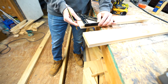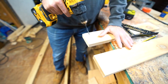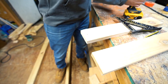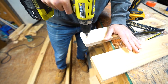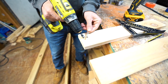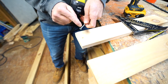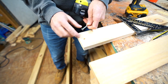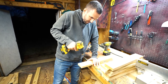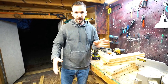So my pre-drill is going to go at one and three-quarters inches. I pre-drill and then countersink — that's so the rounded screw head fits flush in the wood without splitting it, especially since we're drilling on the end. If you don't pre-drill, that little wedge is going to split your wood, especially cedar. Got all of these done: countersunk, pre-drilled, and ready to start assembling.